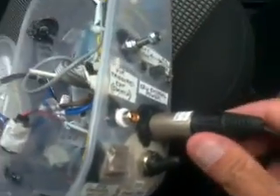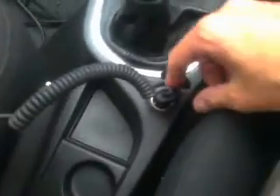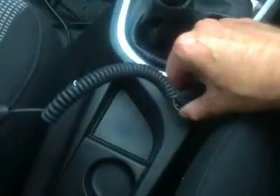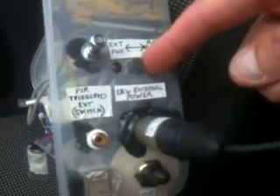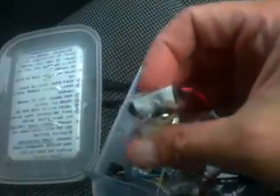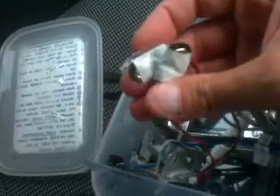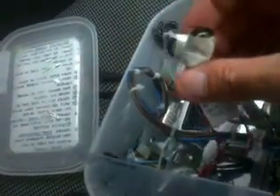This is my 12-volt supply. It's going to be powered by a modified battery. As you can see, it's plugged into my 12-volt car socket at the moment. This switch on the side here lets me choose between external power, which it is at the moment, and internal battery. The internal batteries are these two battery clips here, which are taped over at the moment — eight AA batteries, which make it 12-volt.